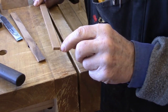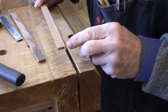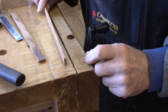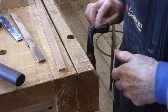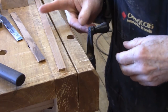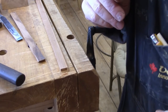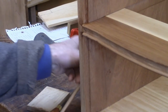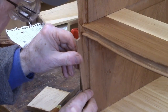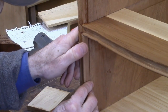All you need is just this little eighth-inch piece — this is straight across. That's going to fit underneath the drawer blade and then miter the other piece of cock beading. Now I can measure it, cut off the bottom square since I'm doing the bottom one, and fit it in. I cut it to length and it fits in the slot here.